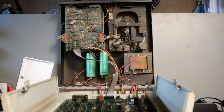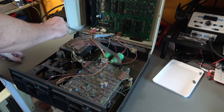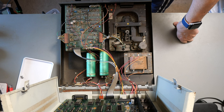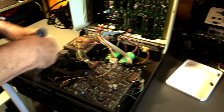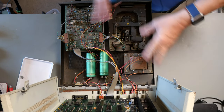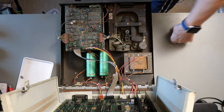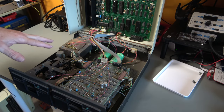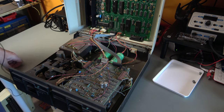So what's almost certainly happened is that the mains connector in here, underneath this cover, has got a filter capacitor in it, and it's a Rifa capacitor, and that has gone. Which means that, in theory, we could still plug it in and it will work at least as much as it did before. But we do need to change that out. And I think, looking at the state of the rest of this, that it would be a good opportunity to just strip this down and clean it.